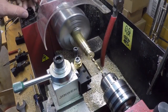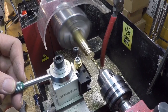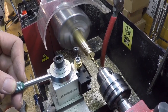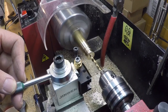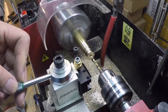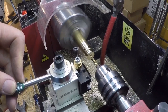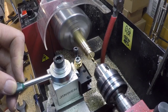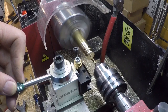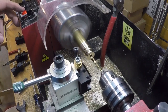A lot of my brass parts were cut right here on this mini lathe. I'll use these pulleys to transmit rotation from the front shaft to the back shaft. So I'm just machining a center hole here so I can mount these on the little axles. A lot of the parts that I made for the diorama were done on this mini lathe here. Cams, some little bushings and the handle fittings and so forth. Great tool for that kind of work.